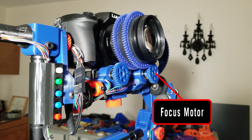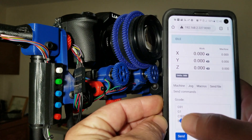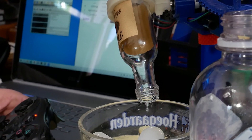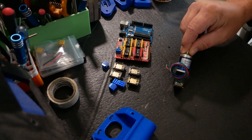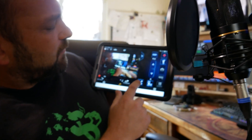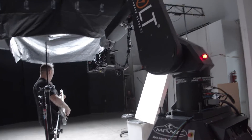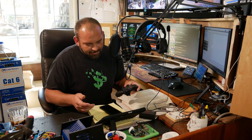It's not an issue with the camera rig but the camera itself. The focus function on my camera is variable and not linear, so focus ends up in a different spot depending on how fast you turn the ring. For the time being I've utilized the focus motor for a different purpose. If you don't need zoom or focus functions, you can use a 4-axis controller, which are way more common and will save you money — the small gear head motors are the most expensive ones on the whole rig. Luckily my camera has wireless features so I can control settings and focus from there. Ultimately this camera rig is not a commercial product and it's not a replacement for something like the Bolt camera, but it is pretty amazing what you get for the price tag. Most of the time I'm not even using the program features — I'll just be setting up a shot, which lets me be the photographer and the subject at the same time.